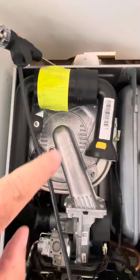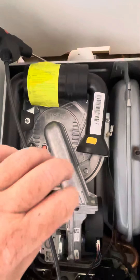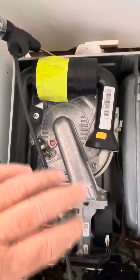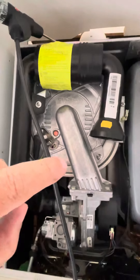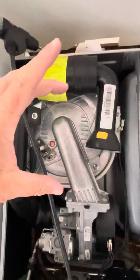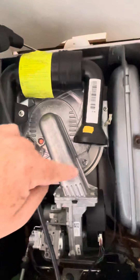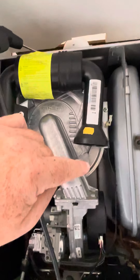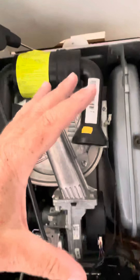But the real reason is that when this boiler first came out, the seal on the heat exchanger was made of silicone — they were trying to cost-cut and save a few pennies. The heat-proof silicone they used was wrong and that rubber seal started to dry out, became brittle, and it started to catch fire.